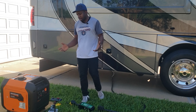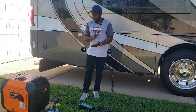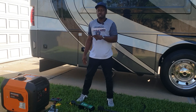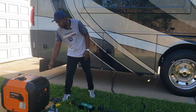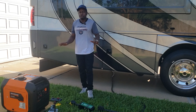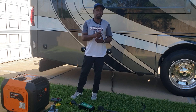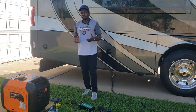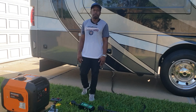Highly recommend. We just finished testing the Generac IQ3500 — awesome generator. It did get to the overload, so I pushed it all the way for you guys. I think it's an absolute perfect generator. One thing I wish it had was a wheel kit — you can get the wheel kit for this generator, and I would recommend getting it. It is a heavy generator, up to 120 pounds, I believe, because of the metal construction. But everything on this generator is a plus. It's quiet, starts every load without dropping the voltage down into the 90s — it stayed right about 112 volts, which is perfect. It's keeping all your equipment on your RV safe. Do I recommend this generator? Yes. It passed my test. Phenomenal generator, really quiet for the size and the power.